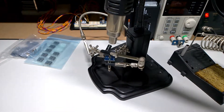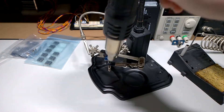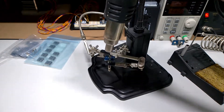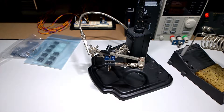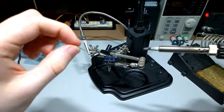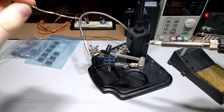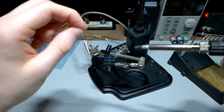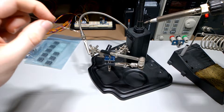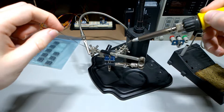You don't have to get it as hot as if you were, say, reflowing surface mount stuff. You just have to get it reasonably warm. Now, make sure your soldering tip is nice and clean, and make a good connection between both the PCB and the banana jack.